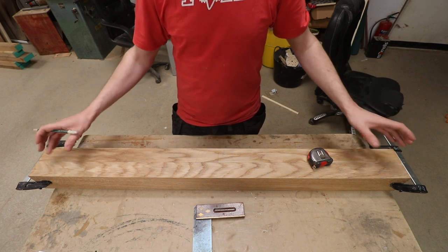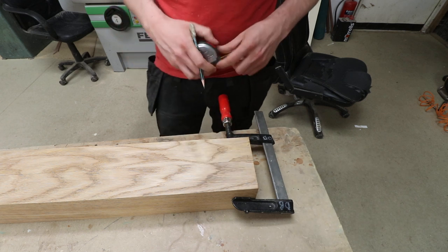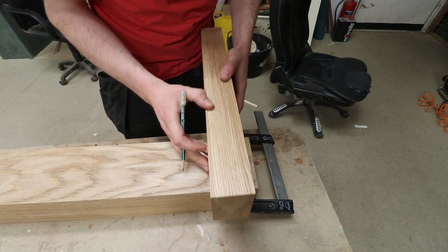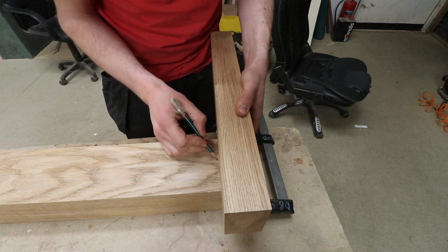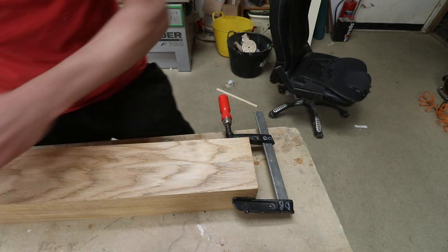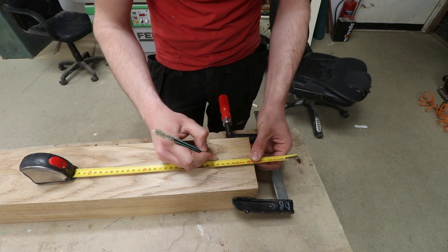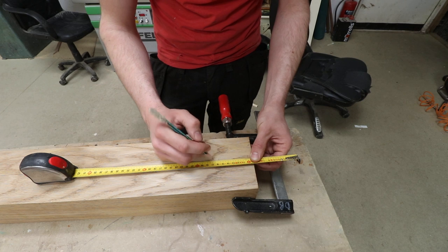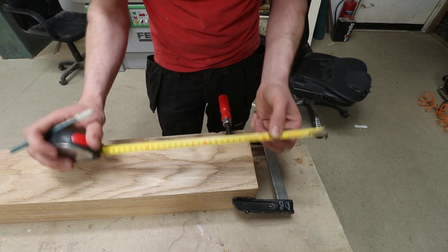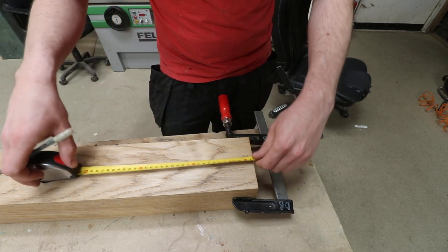Next we'll move on to setting out the two jambs. Okay, so my mark here is for the edge of the window. Now you can either use a physical section of window to mark out the next point, which I know some joiners like to do. So you push your timber up to that tick point, just slightly past it, and then gently tick the timber where the thickness of it comes to. I don't tend to use that method. I prefer to have a real fine tape measure right on the centre of the line and mark the thickness that I've got. I'm pretty accurate with my thicknessing, and it's all set up nice and square and perfect, so working from an accurate tape measure is, I find, more accurate for setting out like this than using lines off of a bit of timber.